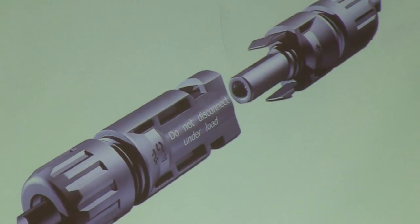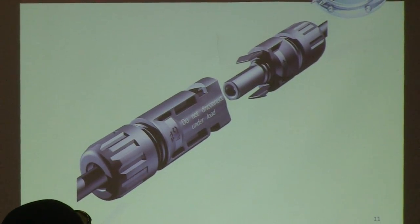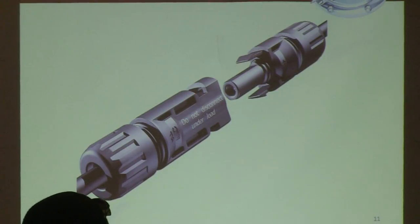And here, and this is key, luckily the solar panels don't have two male connections or two female connections. It's a male and a female, meaning once you've got the right polarity, as you remove and install the panel, you'll never have to worry about mismatching those connectors. Male will only ever go on female, and female only ever goes on male. So it's kind of foolproof, right? And so it makes it easy for removing or reinstalling the panel.